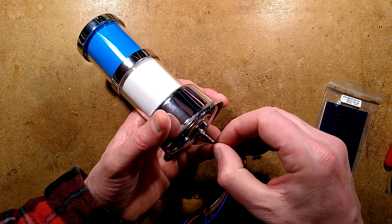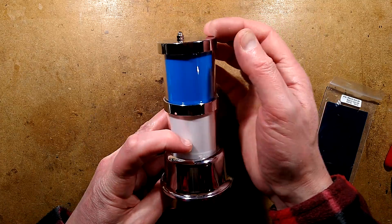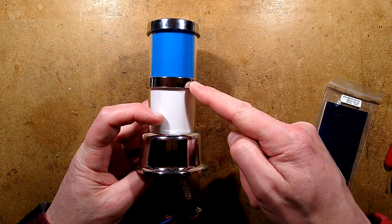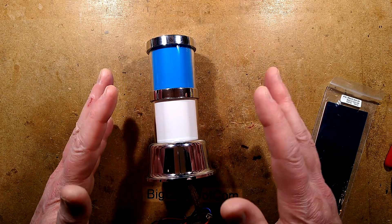That's the reason for this very low resistance braid. It's designed so that if you stick a sparker onto any of this metalwork, or an RF antenna onto it, it will actually ground it to the general equipotential zone in the machine, so that won't corrupt the processor.